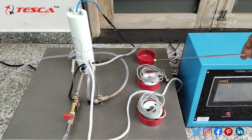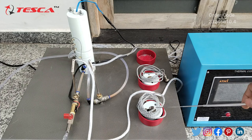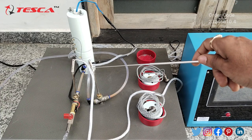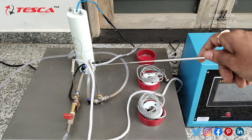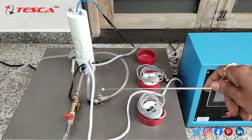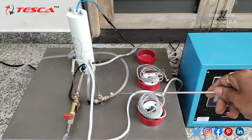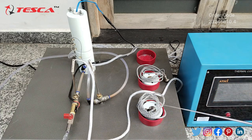Three sections are provided where we place the metal. This is the brass one, this is stainless steel, and aluminum has been placed in the intermediate section. On the top is the heating section, then the intermediate section, and on the bottom is the cooling section. These are the flow connectors, and here we have two temperature sensors — this is the inlet temperature sensor and this is the outlet temperature sensor. Here we also have the drainage.